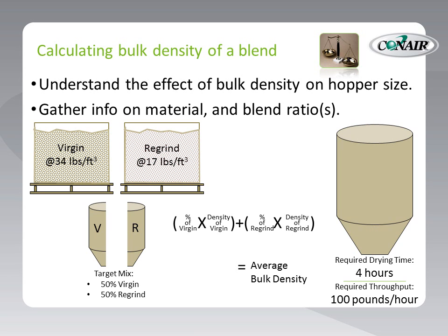Let's use a little math. Although it is best to always weigh the regrind to determine its bulk density, we can take a shortcut by presuming that it is about one half the density of virgin material, which is pretty common. The density of the virgin material is typically part of its description, found in MSD sheets and other descriptive facts from its manufacturer. Our example shows the virgin at 34 pounds per cubic foot, and the regrind is one half of that, or 17 pounds per cubic foot. Our equation factors in the percentages of virgin and regrind along with their bulk densities to determine the average bulk density. Plugging in our numbers: the 50% proportion of virgin is entered as 0.5, and the density of the virgin is 34. We follow the same procedure for the regrind, then add our two numbers together to get the average bulk density. Our answer is 25.5 pounds per cubic foot.